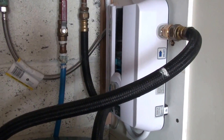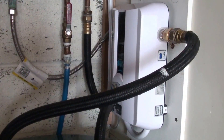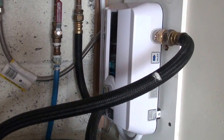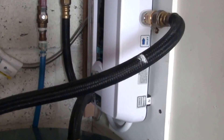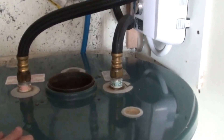If I was taking water right from the city water line, I'd probably only have like 58 degrees, which would not be what you'd want. But because of using the tank here and the de-super heater, that brings my water temperature up to where it's acceptable to use this model.